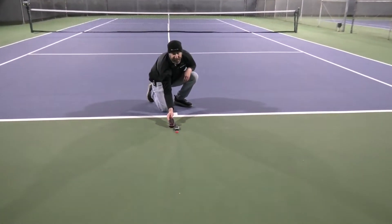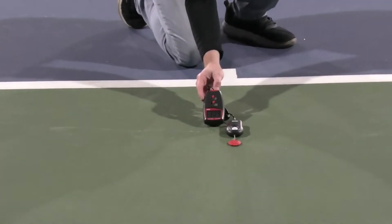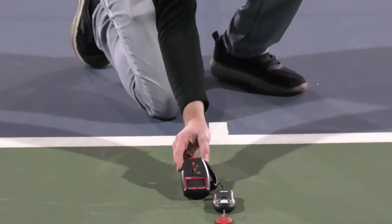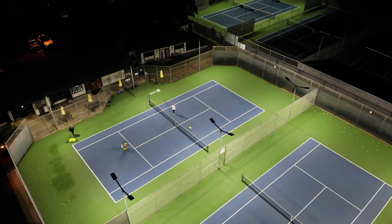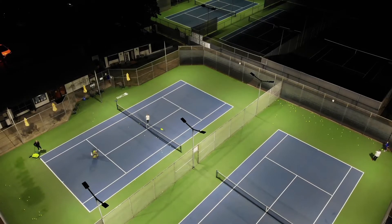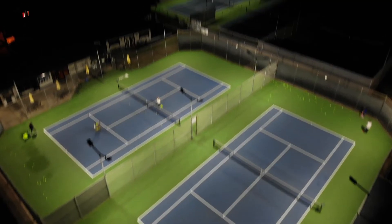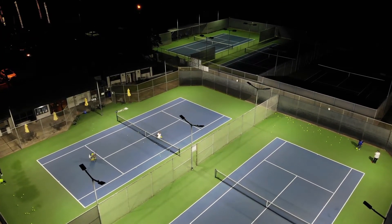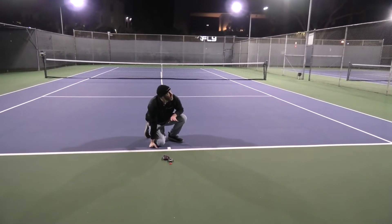Showing you the baseline, just like we did on the other court. We're seeing right about the same — about 310 lux, a little over 30 foot candles — still a 50% increase on light. The other thing is you'll see this is really uniform all around. Where we had eight metal halides, we weren't seeing the exact same light levels in different areas of the court. We've moved from center court out to the baseline and we're getting almost the exact same lux. So we're getting great uniformity out of these nice broad beam angles on these lights.